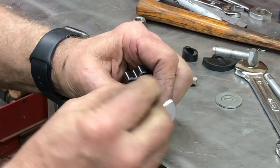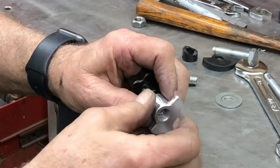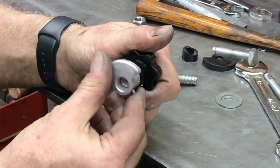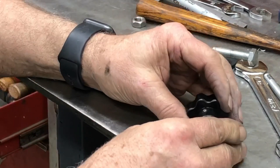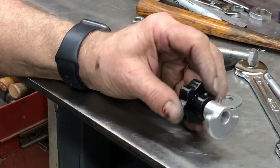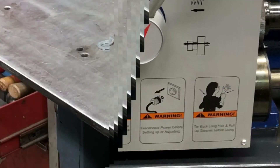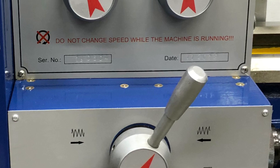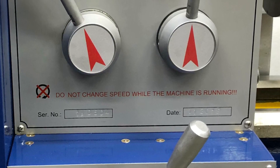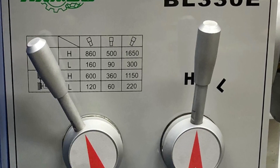There's also a tapered bushing or tapered pin. I'm about to see if it's going to fit and if I have to ream this hole out. I don't have a tapered reamer, so I'll just make the other hole a little bigger if I have to. It works.